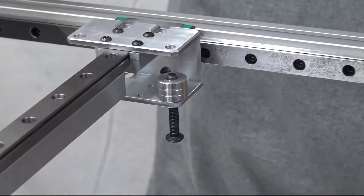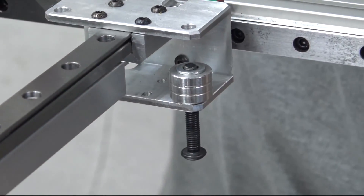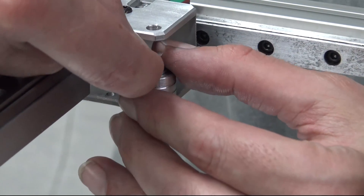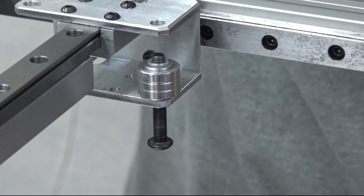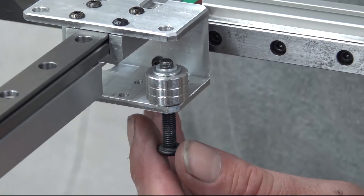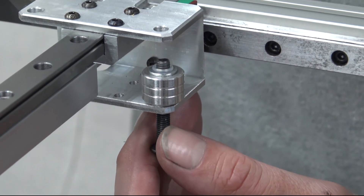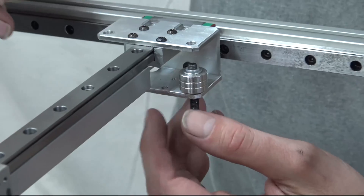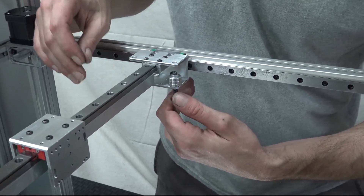I'm not screwing it all the way up because then it makes it harder to put it in there. I'm going to put another washer, then a nylon washer. These nylon washers are pretty cool because nylon is kind of a lubricated plastic. So even if it was to not properly be constrained, it would still rotate and function because it's moving against the nylon surface — it's kind of lubricated, kind of like a bearing. You don't want it to move like that, but I'm just saying worst case scenario.